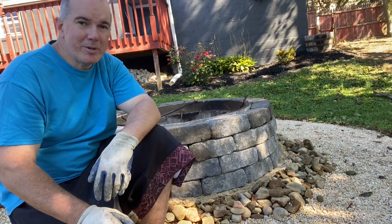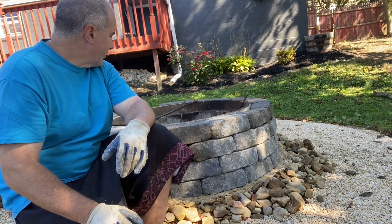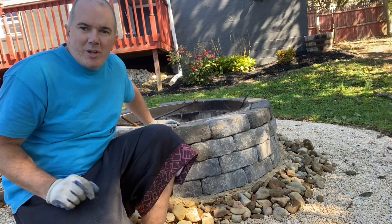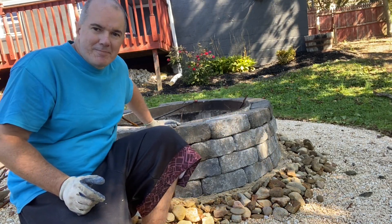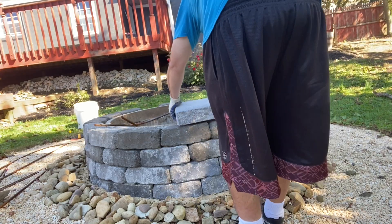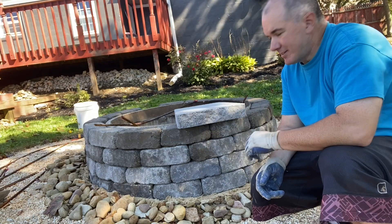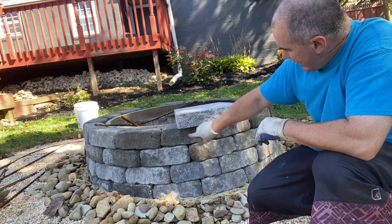Okay, all done and ready for the toppers. One problem — I'm one block short, so it's always good to have extra blocks on hand. As you can see, even though I had half an inch of extra space, I'm just a hair above the concrete ring, but when I put the toppers on it's not even going to matter. Let me put a few toppers on so you can see how it's going to look. You're just trying to stagger everything so none of the lines line up, and the weight is evenly distributed — so I faced one right in the middle.